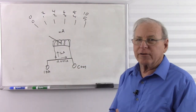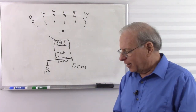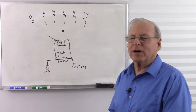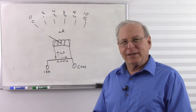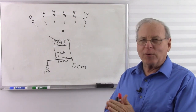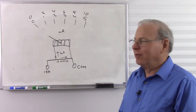Remember: when using the high-current range, that's a dead short in there. Take it back out and put it back in the regular range immediately so you don't accidentally short something out. In fact, once in my classroom I had left the red lead in the 10-amp range, set the scale to 200 volts, and plunged the leads into a wall socket — dead short, and the smoke came out. I still have the slightly melted meter lead. So be careful about that.